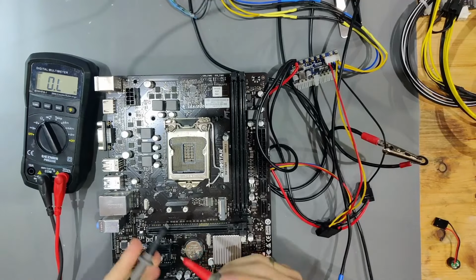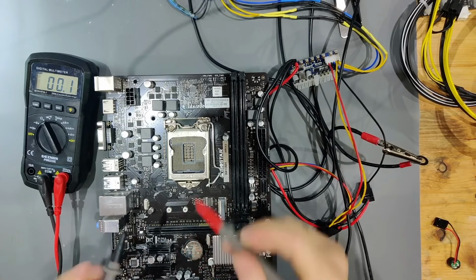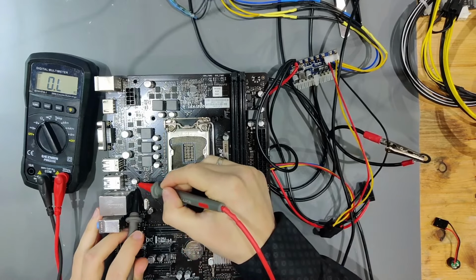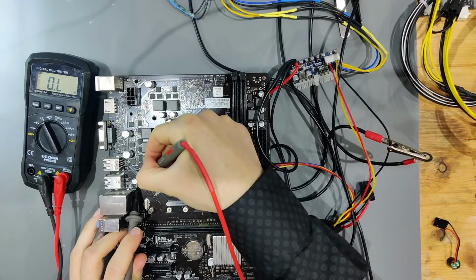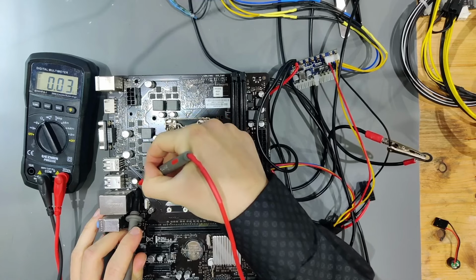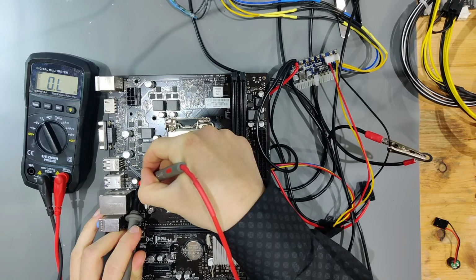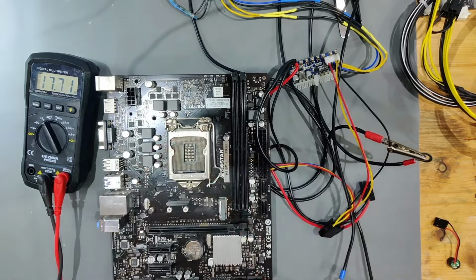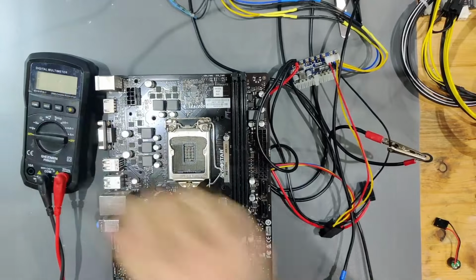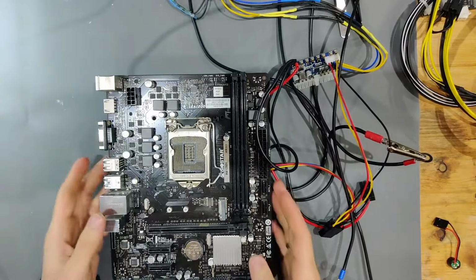Let's get my multimeter. And now let's see, in resistance mode, this is the resistance of my probes. It's basically 0. So let's see, the first resistor right there. Can I even get a reading? Yep, about 20 megaohms and falling right now. So both of the resistors are dead. So these probably need to be 0 ohms.